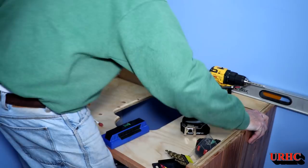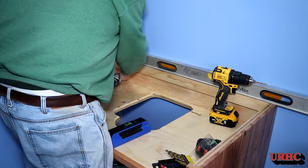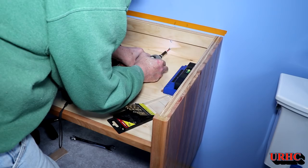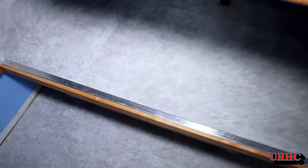Time to go back through and double-check the level, then I used some two-and-a-half inch Kreg screws to make sure it's fastened solidly to studs and the wall. Got a couple of screws into each stud across the back. On the side I had to screw into the wall and put some half-inch shims in because I had left it spaced out. Everything's fastened down tight.